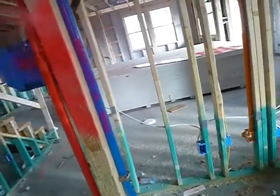And moving on along, this is the vanity. Nailing plates, nailing plates. Now see this piping right here? It's closer than 1.5 inches to the edge of the board. This is where they're nailing. You think a nail's going to hurt that? I do. I think we need a nailing plate here. It wouldn't hurt because this box is not 1.5 inches away from the edge either. In fact, I'm going to start paying a little more attention to those.